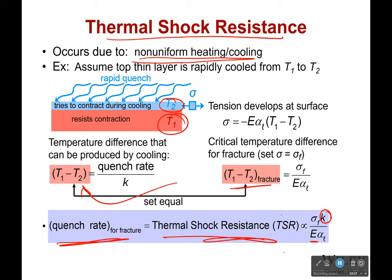Over the modulus of elasticity - this gets bigger and bigger as you get stiffer and stiffer. Something that's very elastic and likes to stretch won't have as much of an issue because it's all going to be willing to stretch anyway. Over the coefficient of thermal expansion: the smaller my coefficient of thermal expansion, the less things are going to be pressing on each other - there'll be less expansion and less contraction, which means there's not much strain, and therefore it won't fail. So all these things are playing together to give us thermal shock resistance.